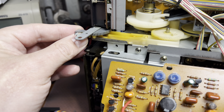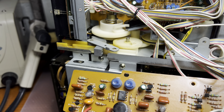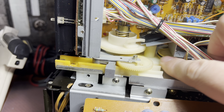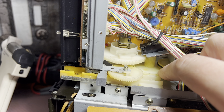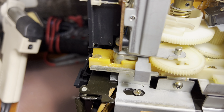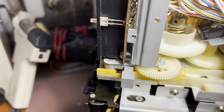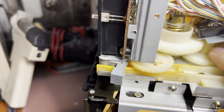This is the far down position and when it goes in it gets here and then rotates like that. So technically there is no room for error. Now let me assemble and show you what's going on. If I rotate in the opposite direction you may see it will now go forward by rotating the gear. And when it gets to the point when the arm sits on this post, it will start rotation versus pushing — it's coming close, and now it will start rotation which will make the door closed.